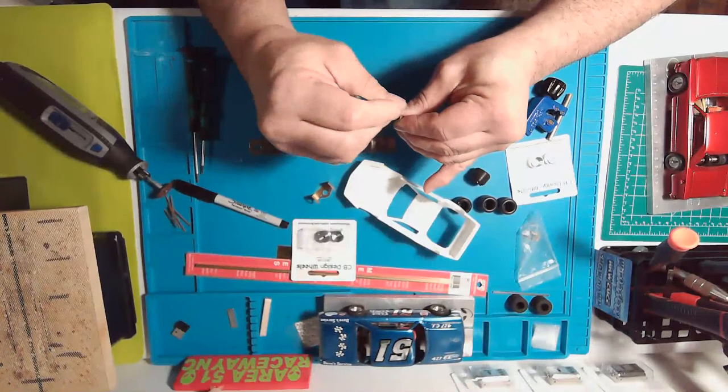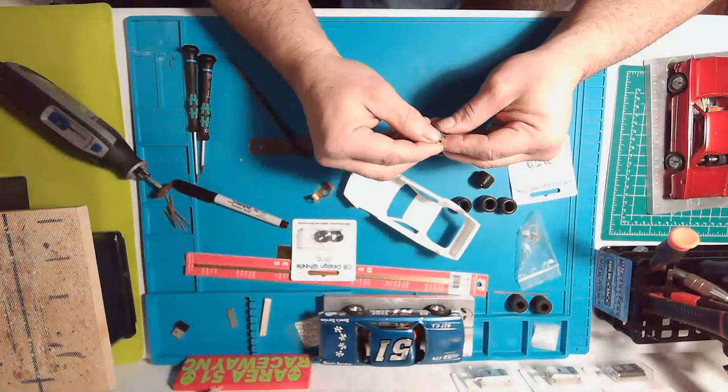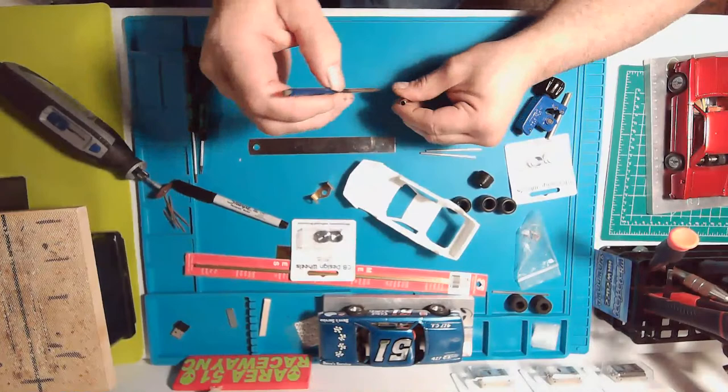Like that. Just make sure you got the edges kind of out of it. This is where you could fit the bushing on. And you get your bushing and your other bushing. Oh, and I didn't do that end. See, the bushing won't fit over if you have that chamfered end. You had to have it cleaned up. So remember that. So we'll clean this end up.